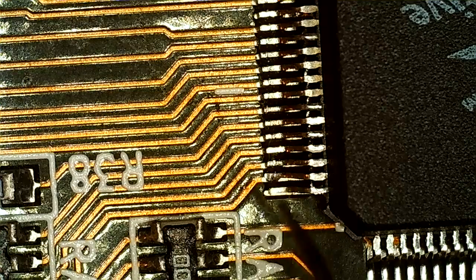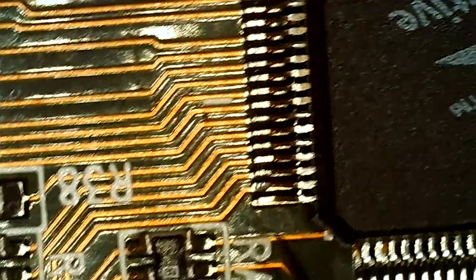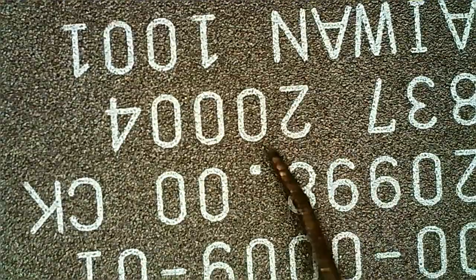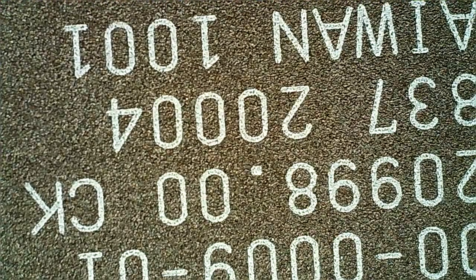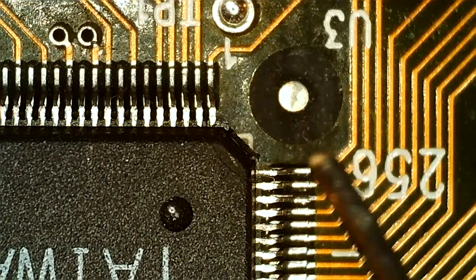These two, I would expect the card to work, I think. A lot of the time, as long as you get the FBI, the frame buffer chip here, to work against the PCI slot, like be detected, usually the computer posts. But yeah, this card hangs the computer, so I can't get any further. So let's solder this into place and try again.